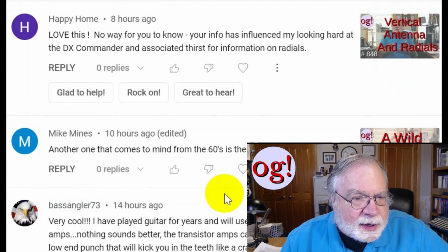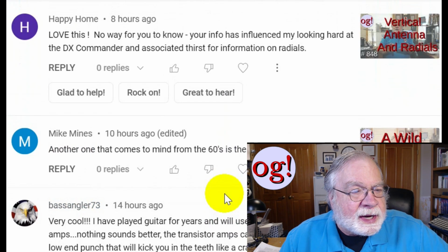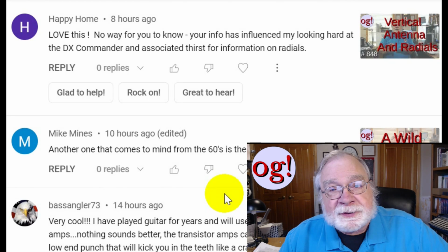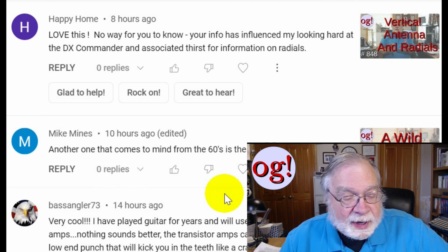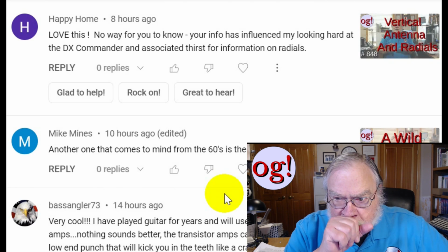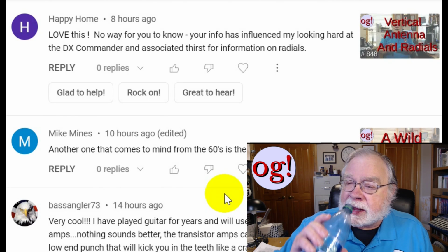Happy Home, in talking about vertical antennas and radials, says, love this. No way for you to know. Your info is influenced by looking hard at the DX Commander and associated thirst for information on radials. The DX Commander is an antenna. The antenna's fine. It works really well. You can tune it down to a net's hind end, and it has a separate radiator for each band, which is why you can do that. And you can do each radiator for which part of the band you want. Although from 40 on up, a single radiator will cover the whole band.